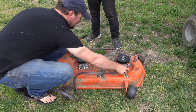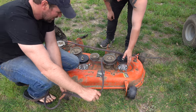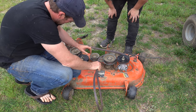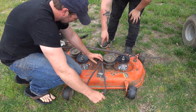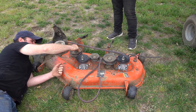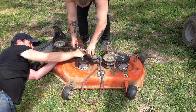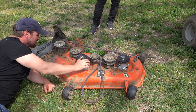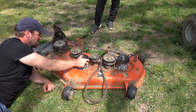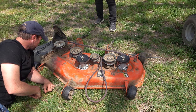The groove part is gonna go across the back into those, and then it loops in. This goes up to the motor on the tractor. The big thing is making sure that the belt isn't twisted. It's pretty self-explanatory. I think this third spindle is definitely stripped too — but once the tension's on the belt, it's gonna stay in position and spin. This probably came loose and started wiggling because the mandrel was bad for a long time. I just didn't want to fix it because that would require effort.